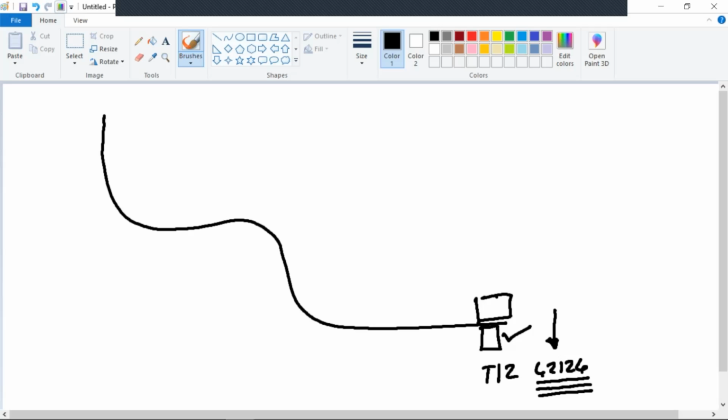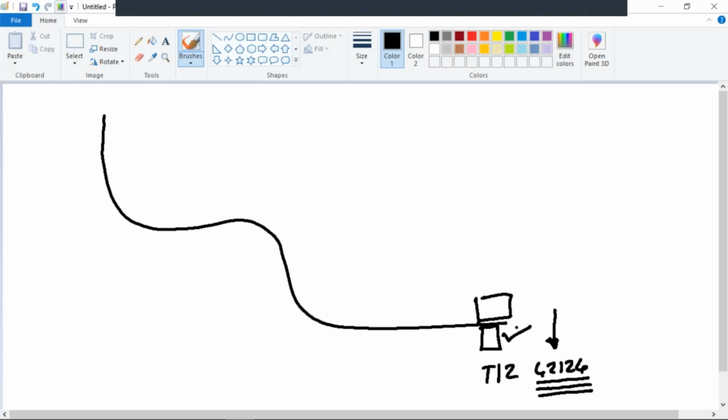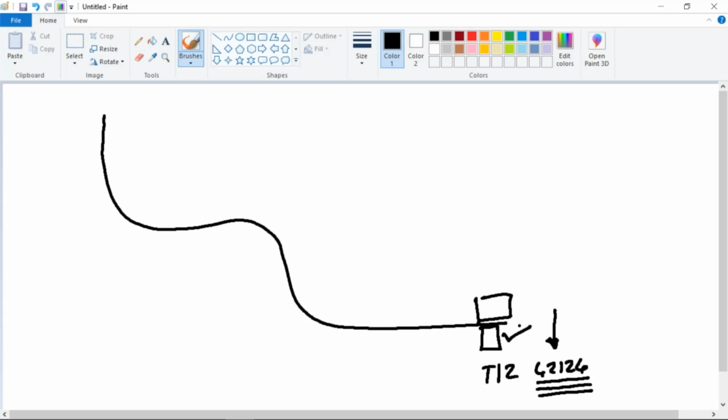Yep. Even with mobile mapping, I can't emphasize this enough. That is a tool. It is not proof. So if you need to do switching, if you need to confirm anything, always use your safety gear. Always confirm the feeds first. Don't assume that what you're getting from the mobile mapping system, or any kind of mapping system, is fact. With mobile mapping, you rode around all day and used it, took it into the shop in the evening, put it up to a charger, and it automatically updated every 24 hours overnight.